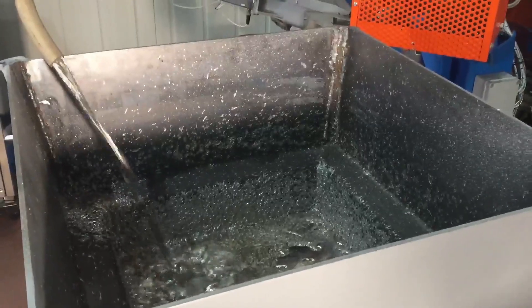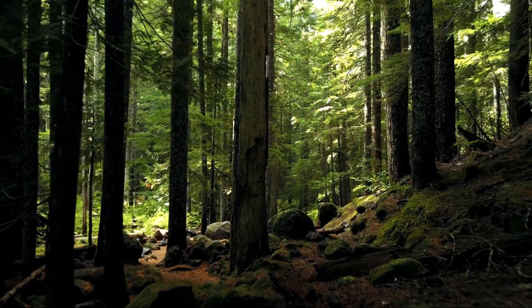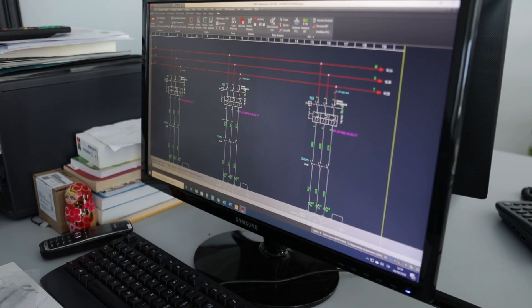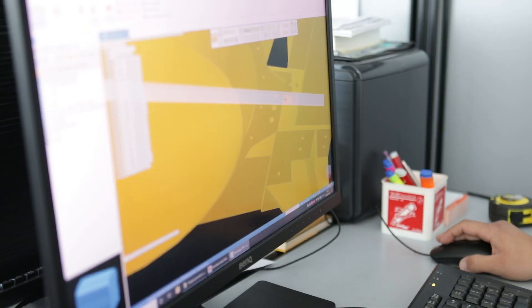We achieve a melt temperature of around 400 degrees in just 20 minutes. FastMelt is a safe system — it has been designed to isolate residual magnetic fields thanks to an aluminum shield. We have done exhaustive testing to measure the magnetic field and recorded values lower than 10 microtesla.